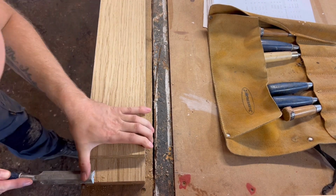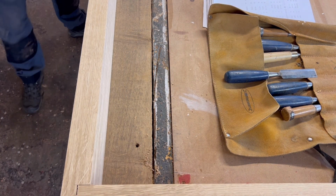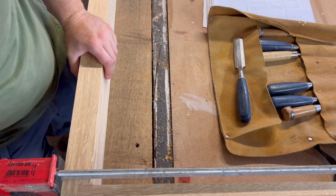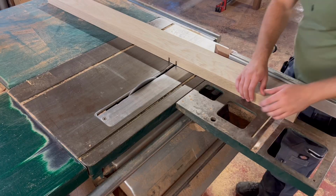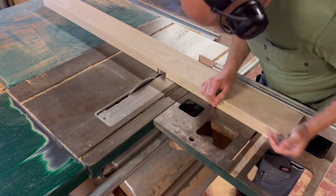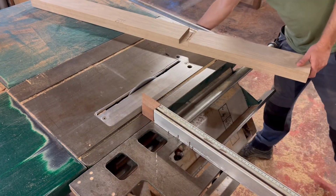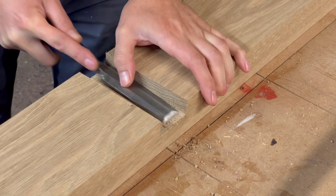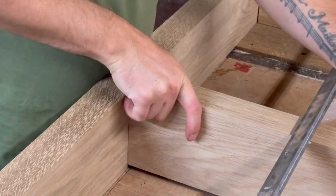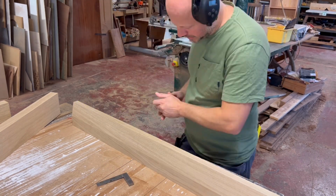So I started off by making the frame for the door, chiselling out the joints to clean them up and clamping it tight. So then I took the header for the frame to the table saw and cut the housing for the middle style of the frame. I do this by setting the height of the blade on the table saw, taking it out in consecutive cuts and chiselling to clean up the leftover. Then fit it together.